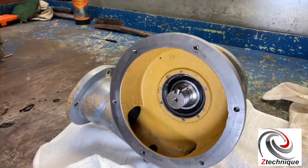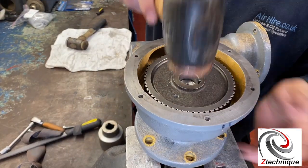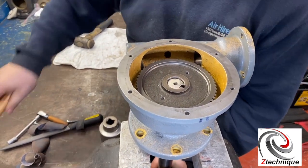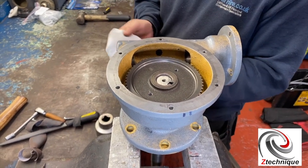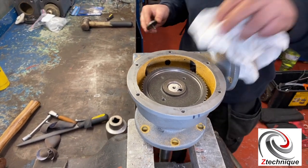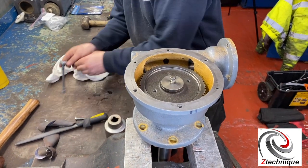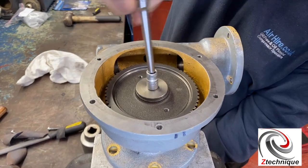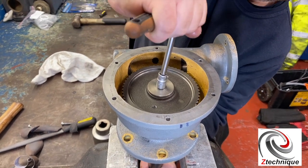The next action has been to put the keyway in. You've got to make sure it's nice and level inside the keyway itself, so this should be quite an easy fit onto the shaft. If you have trouble getting it on, it's most likely you've got some sort of burr on the gear, the keyway, or the shaft itself. And there's a retaining washer screw — just nip it up tight and pull the gear down the last bit of the way.